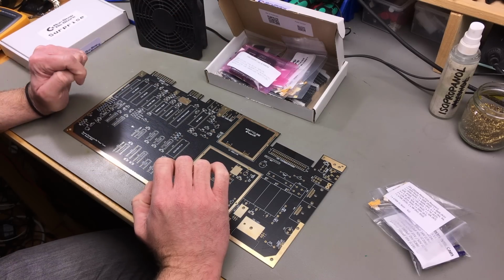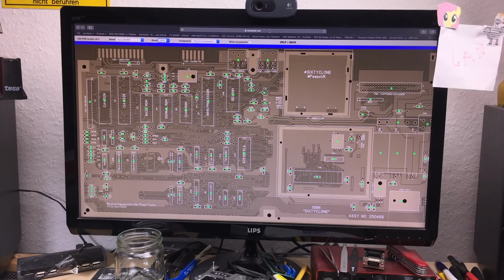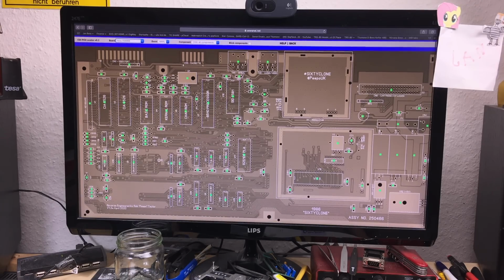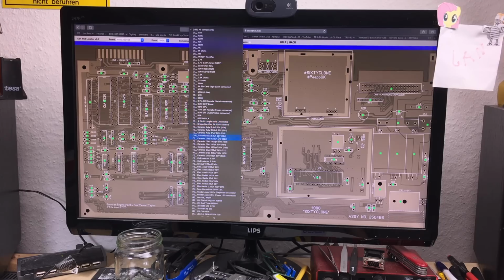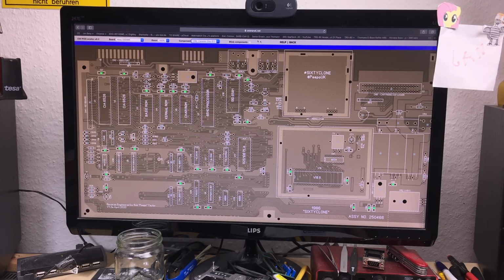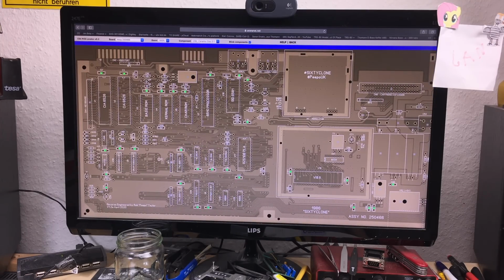But there's something better that my friend Edu Arana set up on his website. I'm going to show you. Enter the C64 parts locator or PCB locator on arananet.net, which is also going to be linked in the description. Edu has the assembly 250466 all laid out here, and we have a little drop-down menu where we can choose the components and see where they actually go. We have these little green lights, and we can also have them blink. We can see where the ceramic disc capacitors go that we chose in the menu. This is going to be really useful for this build. Thanks, Edu, for providing the world with this parts locator.